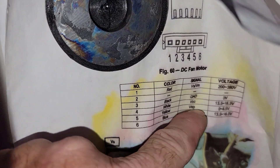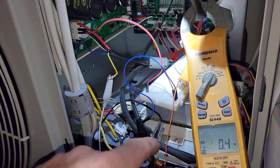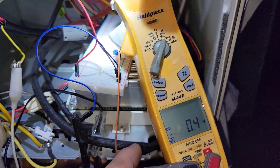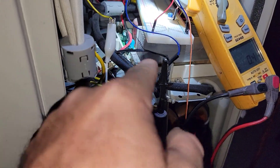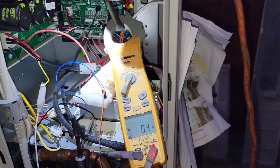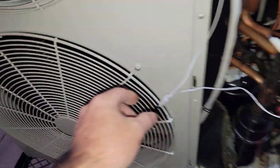I'm unplugging the speed — zero to 6.5 volts — and got just a couple resistors and a potentiometer in there. I'm basically taking the voltage, which actually comes from this inverter board, because of these three-phase DC motors. I was hoping they had built-in controllers so I could just control the motors directly, but they don't. So I need to keep this motor driver in there for these two fans, but it works with this type of control just like the built-in circuitry.